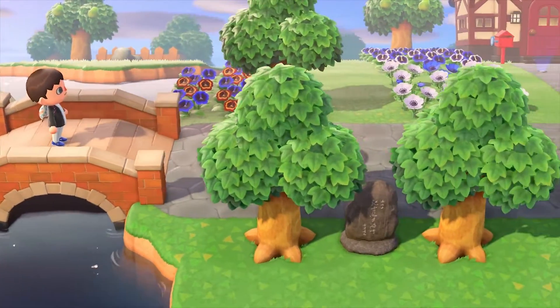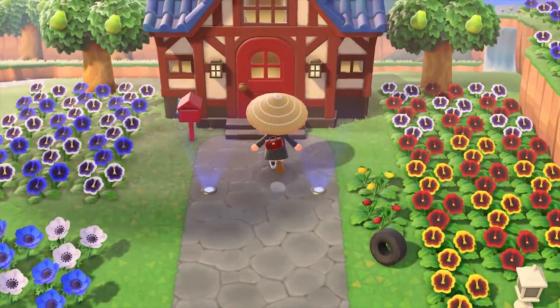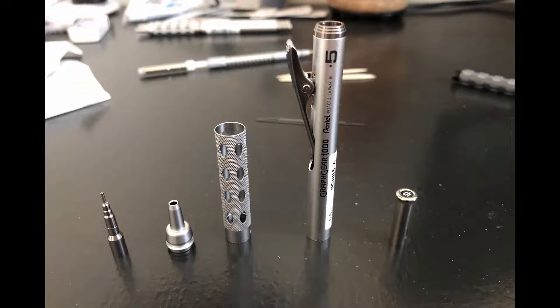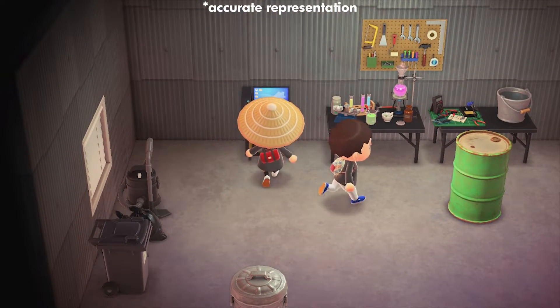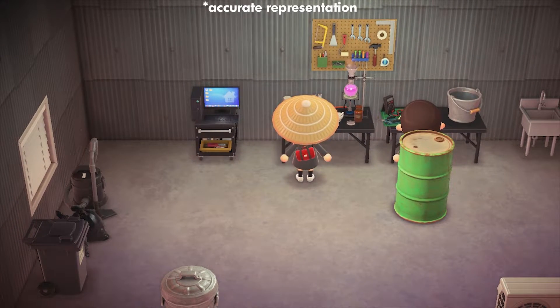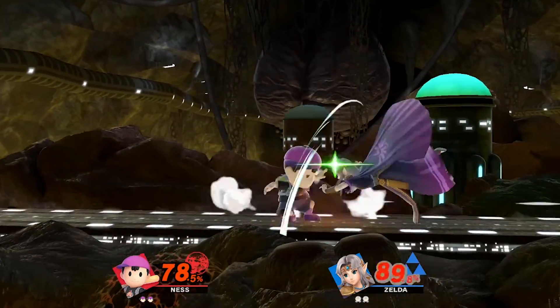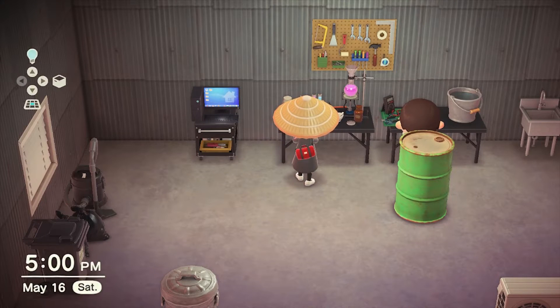Last week, Austin came over on Friday, and that was the day we were going to anodize the pencil black. We started by taking it apart, then cleaning it off with our degreaser before putting it in the sodium hydroxide. We left it in the sodium hydroxide for about 30 minutes — in the meantime we were just playing Super Smash Brothers — and when the 30 minutes ran out, we sprayed it off with water and put it in the sulfuric acid bath.